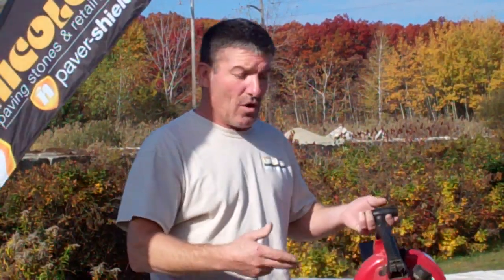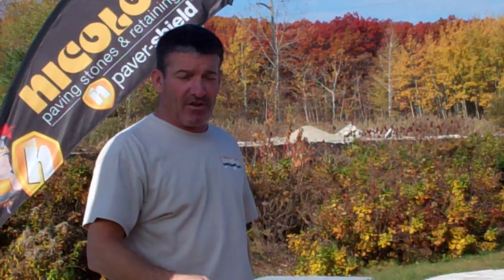Now I'm going to just stop this, clean it up, and I'll show you what we do with the leaf blower. Okay, now we talked about putting it in with a broom. Now I'm going to blow off the excess with the leaf blower, whatever kind of leaf blower you got. Don't blow directly into the joint and blow it out. You want to just do it at an angle, blowing all the excess off, so when you spray it, it's not all stuck to the pavers, okay? You just want it in the joints.